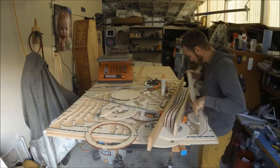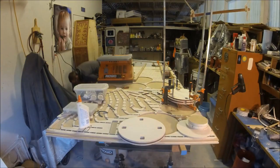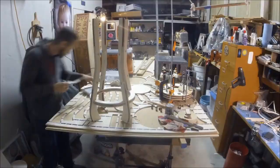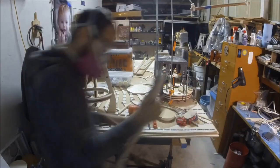I did end up fitting everything and tweaking things. The material I used was 3/8 inch thick birch plywood from McBeath Hardwood in Berkeley, and it was actually only 355 thousandths thick as opposed to the nominal 375. I did adjust the tool paths for that, but I might have forgot on the footrest because it fit a little loose. I ended up putting some shims in there to get that to fit nicely.